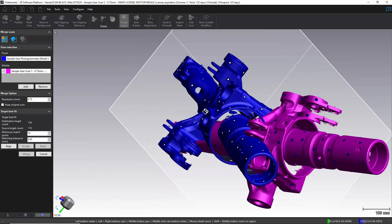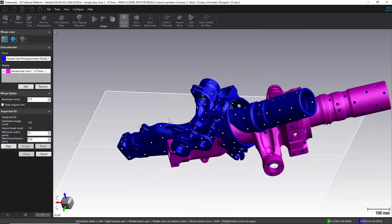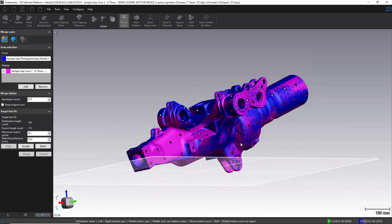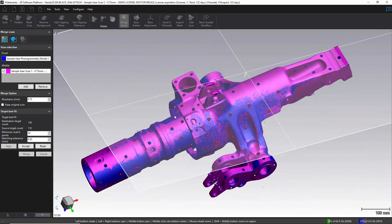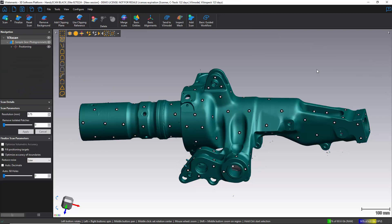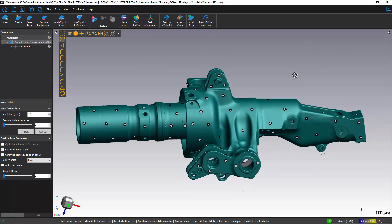Now the second scan has shown up. Currently they're just overlaid on each other, not aligned at all. We have three different ways to merge scans: the first is based on common targets between the two scans, the second is based on common surface geometry, and the third is a fine-tuning when we have more than two scans. In this case we have common targets between the two, so I click on the second scan, set the minimum number of targets — we'll try 30 — and hit the align button. And it's that quick: they snap in to be aligned to each other, and the targets that have gone red are the ones used for the alignment. They're distributed all the way around the part, so we're quite happy with that. We accept the result and click merge. The merge is complete and the final combined surface has been generated.